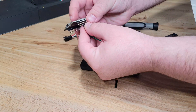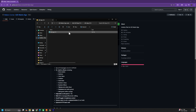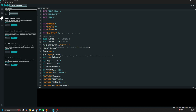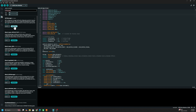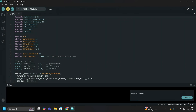Now it's time to install our ESP32 — but first we need some software. Down in the description I'll have a link to my GitHub page where you can download the zip file. Once downloaded, open the Arduino sketch and we'll start from there. With the Arduino IDE open, we need to install some libraries. The first is the NeoMatrix from Adafruit — this is how we control our LEDs; when you click on it, it'll ask if you want to install its dependencies, just hit yes. Then search for Wi-Fi Manager and install that library as well. Plug in the ESP32 via USB, make sure it's selected in the Arduino IDE, click upload, and wait for it to compile and send over.